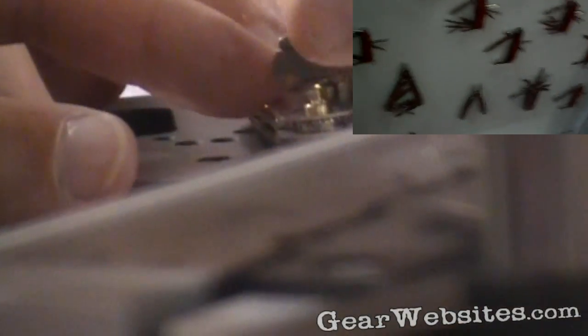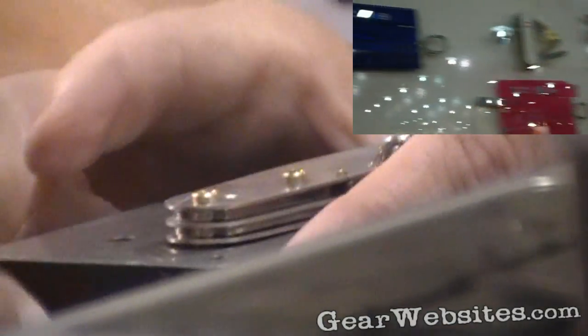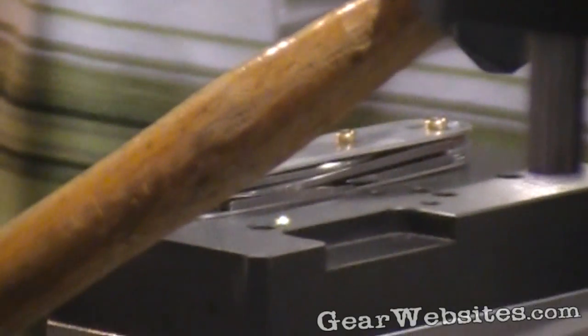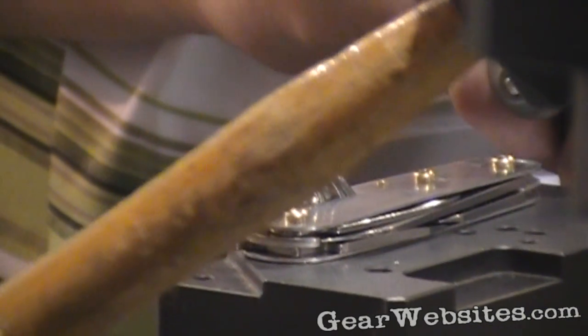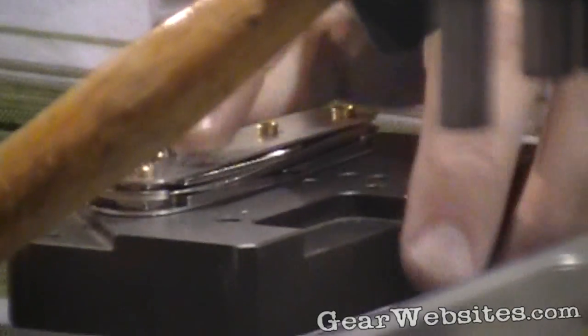Just move this guy back out hard. Slide over. Yeah, just like that. It's perfect. I'll take this and put this over here. You're right-handed. Take the hammer, and you have a punch. You're going to hold with your left hand below the spring. The spring action will move this whole punch and will actually sit right on top of that bushing. The punch will come out. It's the center of that brass pin, and it'll just mushroom out straight through it.